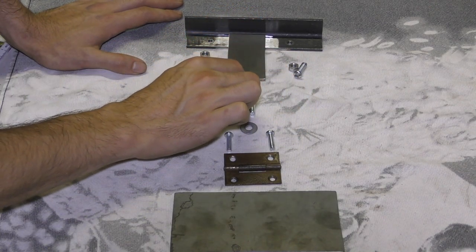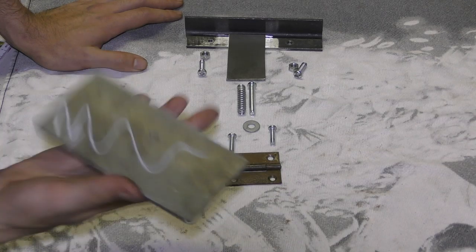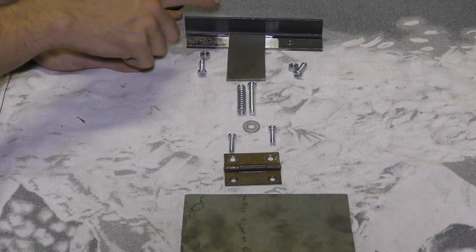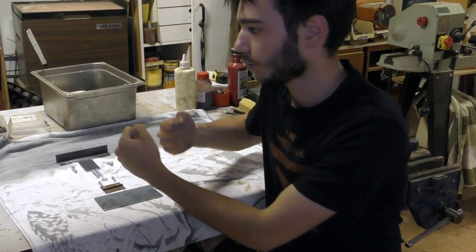You won't need this part if it comes out to maybe a 15mm wide piece of angle iron — I probably wouldn't use this part. Next, we have two M6 bolts and compatible nuts — a 40mm long M6 bolt — with a spring, about the same, and a M6 washer. We also have two M5 bolts. I tried to go for a little bit heavier of a base, and that's just mild steel again, about the same size as this piece of angle iron.